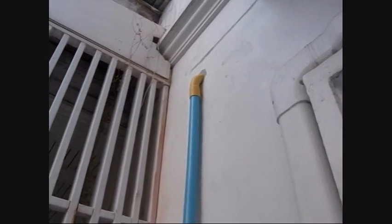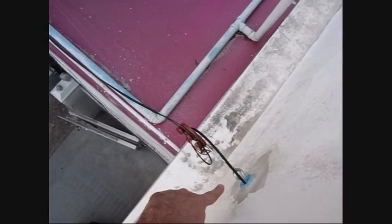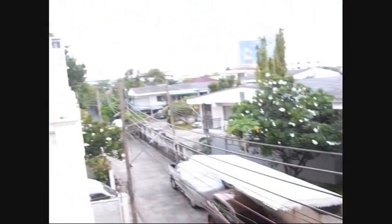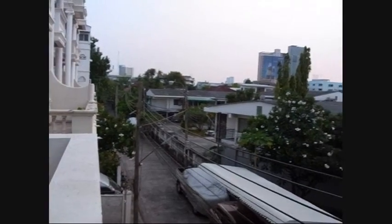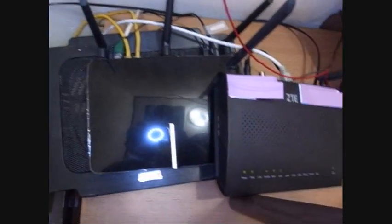The pipe goes up through the roof as before. Now you can see it's completed here. Comes down here — need to clean it up, it should be back against the wall. Goes out that way, along here, through there. Has the strain relief here and the loop that I put in. Goes out there and then all the way back out to the connection point — one solid piece. So that's it, that's the job. It was a lot harder because of all the extra fiber, but it does work. We finally got the internet we've been paying for and never had. Hope you found it interesting and perhaps useful.